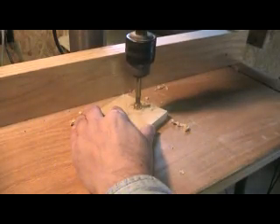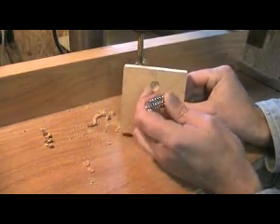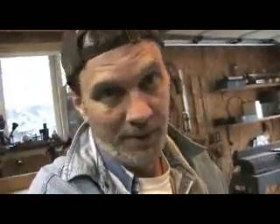Here's the box — I've just got it all sitting there. Obviously I haven't cut the bottom off yet. This is the part that's going to slide open. I've got the top, the quarter-inch MDF cut to size, and I've also cut this little pressure plate that goes in and slides against the rollers. Right now I'm just boring some shallow holes using a Forstner bit and my drill press — this is that front panel, or back panel, that will hold these springs. I just wanted to have a hole that I can glue them into. Now I'm drilling some shallow holes on the pressure plate too.